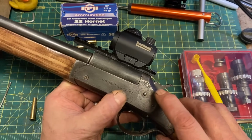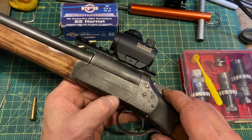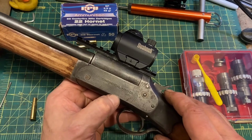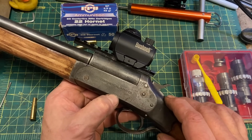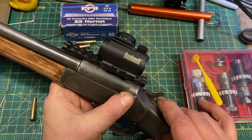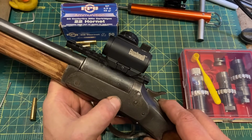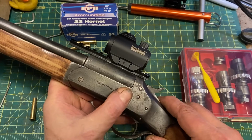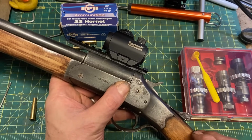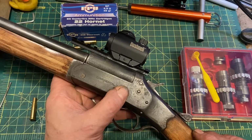What I determined was that the original pin, which was about 1/10 of an inch in diameter, was not playing well with the cutout necessary to allow the firing pin full movement, and it was simply evading the pin and flying out. Also, the last time it marked the pin significantly, and so I had to fabricate a pin out of music wire. I decided to go big.